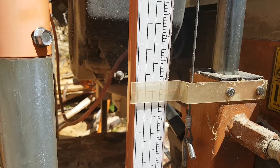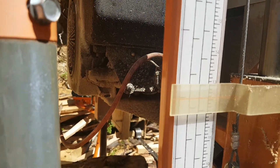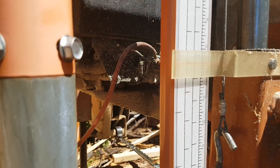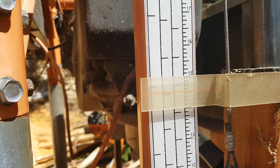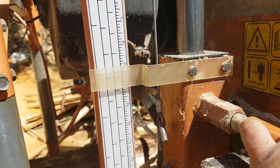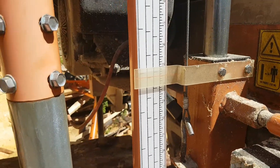So what I want to do is split that four-inch difference. I'm going to bring this end up from 12 and a half up to 14 and a half. Then I'll tighten the T-handle up here so the head doesn't move.